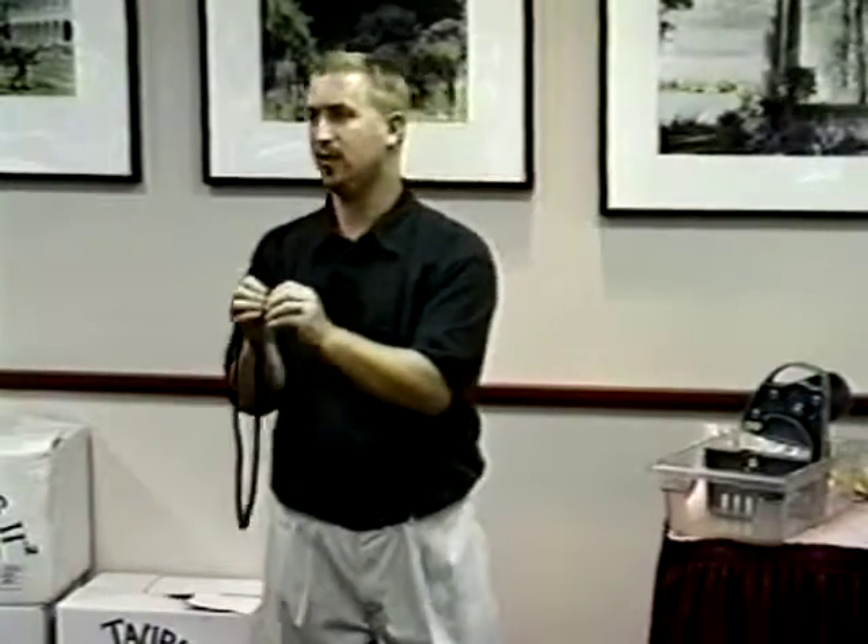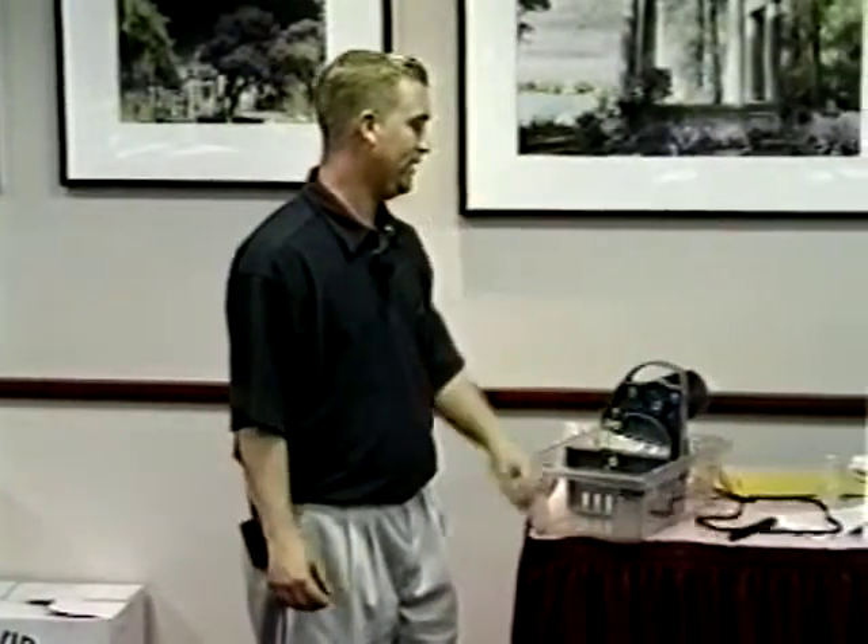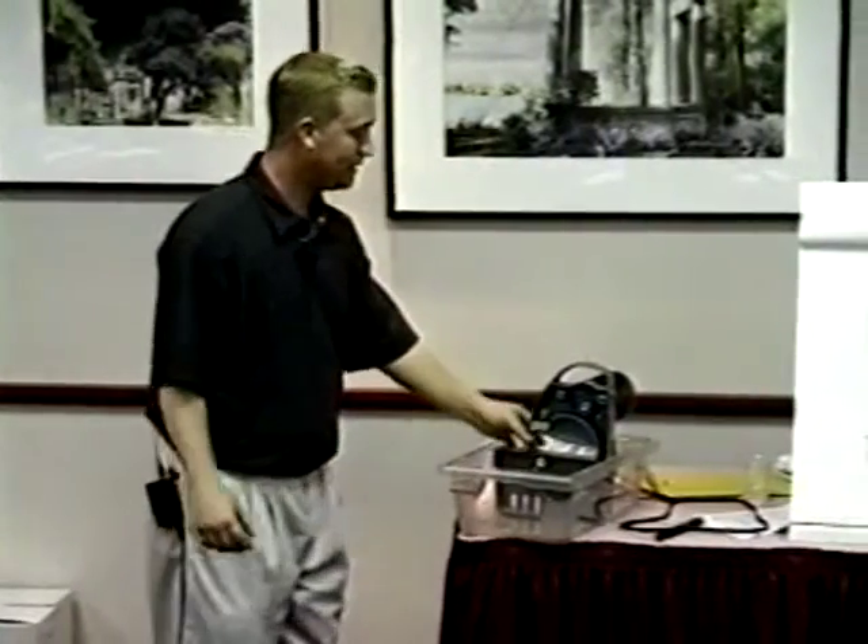That Kevlar I'm talking about — if you take a look at your saw right now you can probably see the Kevlar in the middle. It's kind of copper, kind of a reddish-orange color. You're going to look in that groove and you're going to see that copper color — it's time to replace your belt. You can run it as long as you want until the thing won't move anymore, but why would you want the headache? They're not that expensive, especially for the amount of time that they last.